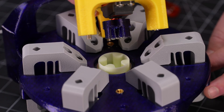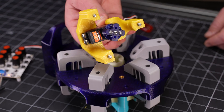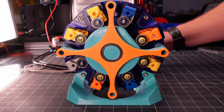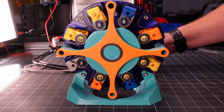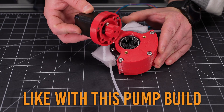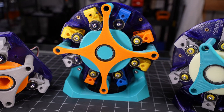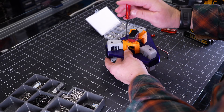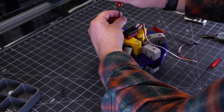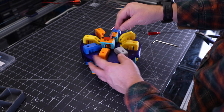To drive the motion of the cam, I integrated these clover coupling features into the drive side, and for now I'm using these 270 degree RC servos to drive them. Unfortunately that 270 degree range of motion means that one of the valves on both the 6 and 8 channel versions isn't accessible, so I may upgrade this to something like a stepper in the future if I want to get the full use out of it. But I went ahead and assembled the full sets of valves anyway — symmetry. The servo then gets attached to these mount brackets on either side that then get mounted to the valve, and this configuration will allow me to swap out the servos for something different fairly easily by just making up alternative motor mounts.